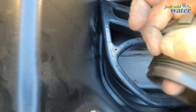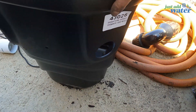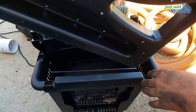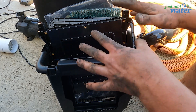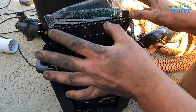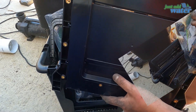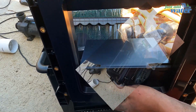I've got the new skimmer right here — here's all the stuff that it comes with. You've got your skimmer rack — this just goes in there and prevents the sides of the skimmer from caving in on itself due to the ground settling around it, frost, all that. It stays in year round; never take it out unless you're getting access to the pump for cleaning. Here's the faceplate, and here are the bulkheads. This is how the bulkheads go relative to the water level.